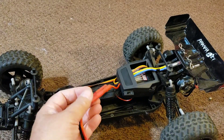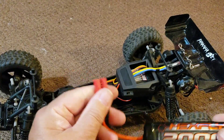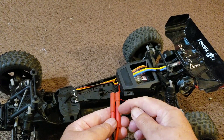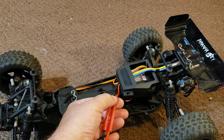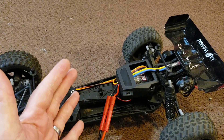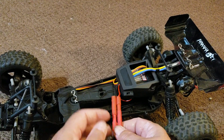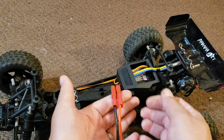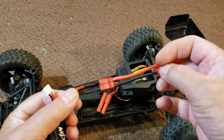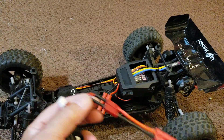Connect positive to positive and negative to negative. You want to make sure when making any connections — even with your stock battery — that you press them on all the way. You don't want air gaps between the copper inside each barrel, because that can cause arcing, which creates extra heat and can start a fire. Make sure it's pressed on all the way. This whole assembly runs around six or seven dollars — I'll have a link in the description.